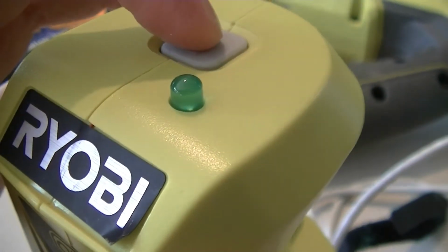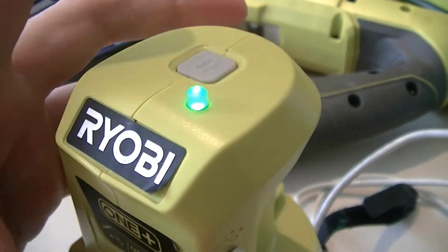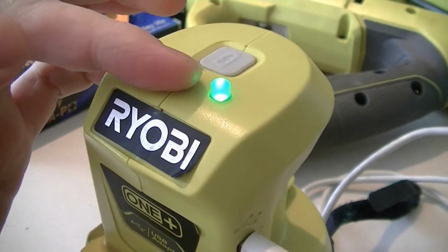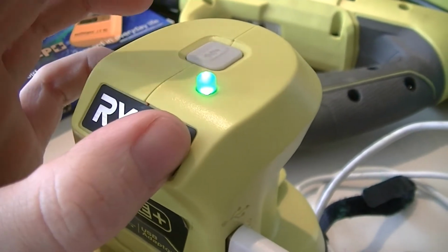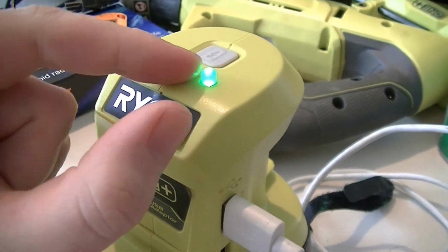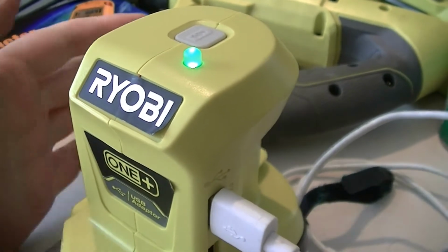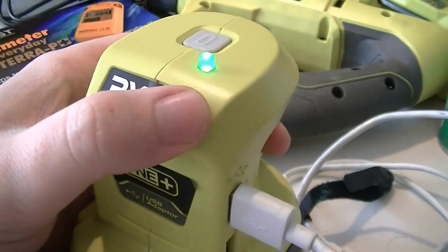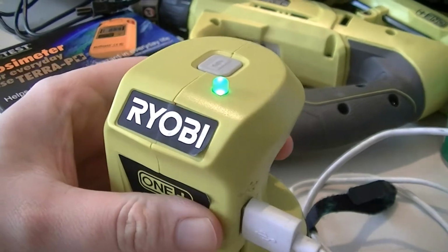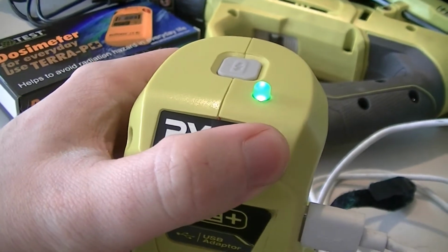So that's why there's this T1 3/4 high brightness green LED there. That's just to say that, hey, it's on. And the reason I used a high brightness indium gallium nitride die LED is because the drive current of that is somewhere in the order of about 400 microamperes, plus or minus a few tens of microamperes. Didn't exactly measure it and don't particularly care. It's one of those in series with a 5600 ohm resistor.